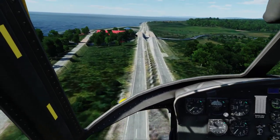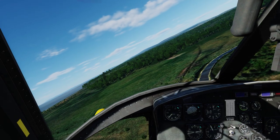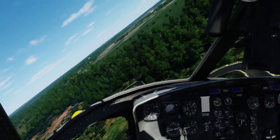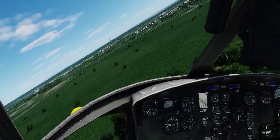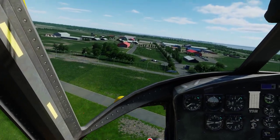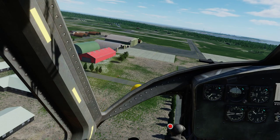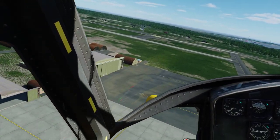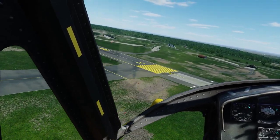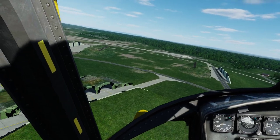Feel free to put in more collective if you want. You can fly out of ground effect without any additional collective — which only defines the average pitch of the rotor. You set the rotor pitch with the collective lever, and then the governor automatically adjusts power to keep the RPM in range. So just by the way you fly the aircraft, it causes changes in power. It's a lot like the German aircraft with the Kommandogerät — the automatic engine controller.